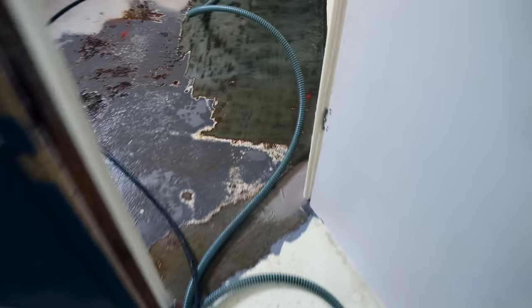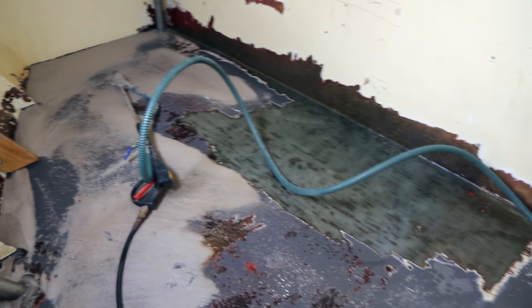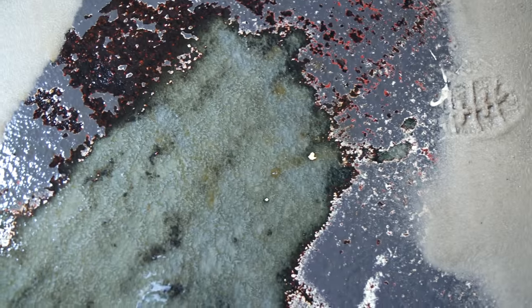So we've gone through maybe three lots of sand in the sand pots. Each one's about 30 litres, so we've got through about 90 litres of sand all up. That kind of gives you an idea of the area that's been covered. We've dug pretty hard into this edge right the way along here because there was rust. You can see it as little black dots and things like that. So here's a good example, right? Floor rust. It is surface rust, but it doesn't take long to get it straight back to being lovely white metal. We just have to take the time and go through it and rip it all off.